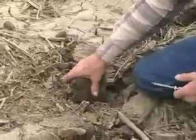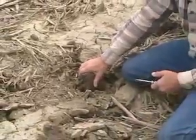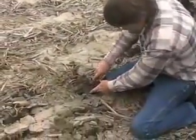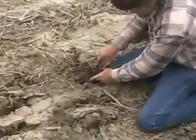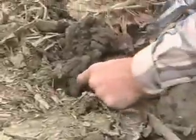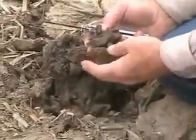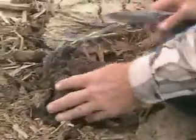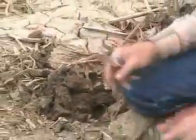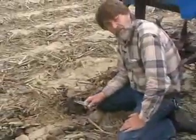This soil has been lifted because it just tends to adhere to the tine. It's that kind of moisture today. But this soil is interesting in that even though it's been lifted like this and worked, you'll see there's amount of fracture that's in here, the soil is actually quite friable. This is not really compacted. The lifting sliding combination action of the tine does a very unique job in terms of soils that would appear to be too wet to till.